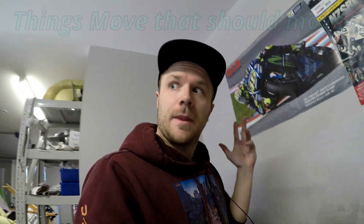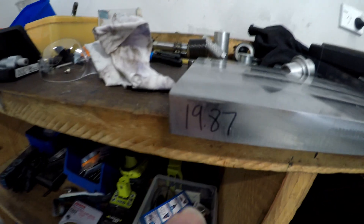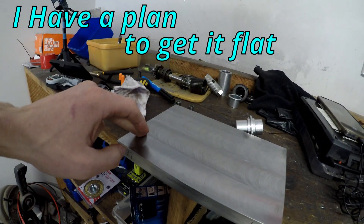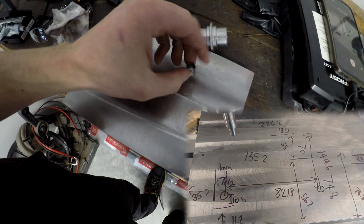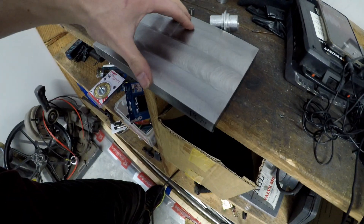I've been doing some off-camera machining because frankly that machine was getting on my nerves, but I have a surface that is pretty flat. I've measured it with my micrometer and I've got a difference of 0.08mm height from one edge to the other. It's also symmetrical. I've got all my measurements to plot out the four holes where the head bolts and dowels are going to go. I also cleaned up the sides for clamping nice and square.